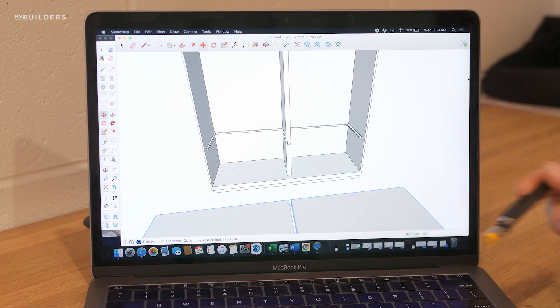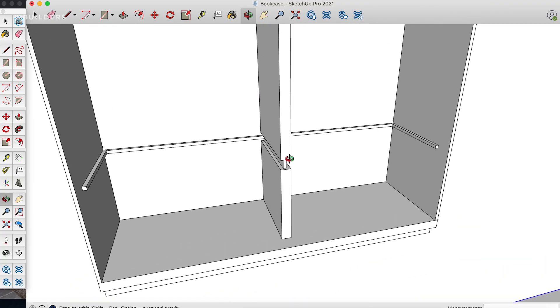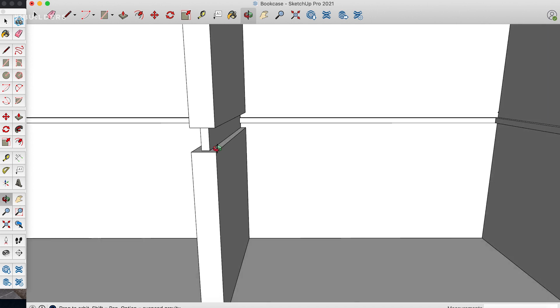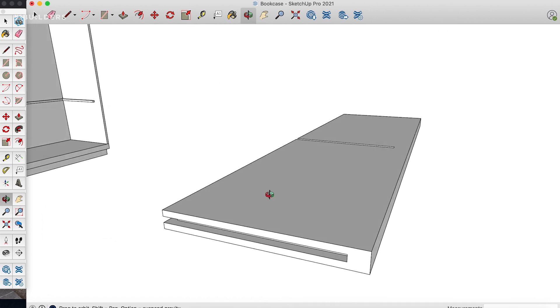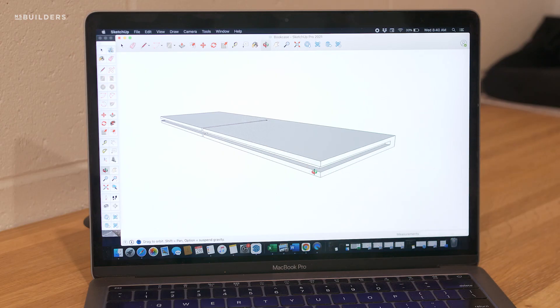You can see I have the cleats on the sides as well as going through the back. This vertical support is two and a quarter inches — just three layers of plywood. The center layer is going to remain full length the entire run and we're going to notch in for these shelves, doing a lap joint on the verticals where they meet the horizontal shelves. Spinning around and zooming in you can get a better idea of what those vertical joints are going to look like. On the shelves, the center layer of plywood is set back a little ways, which will allow us to rest our shelves on those cleats. I want to do this prior to assembly.